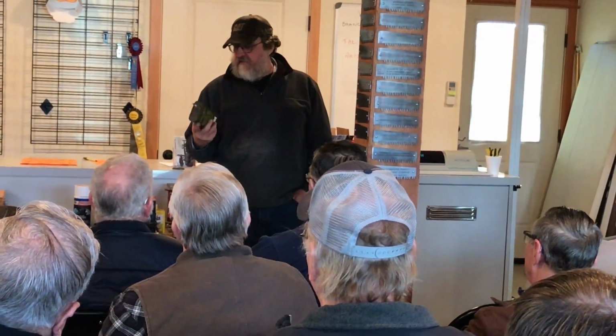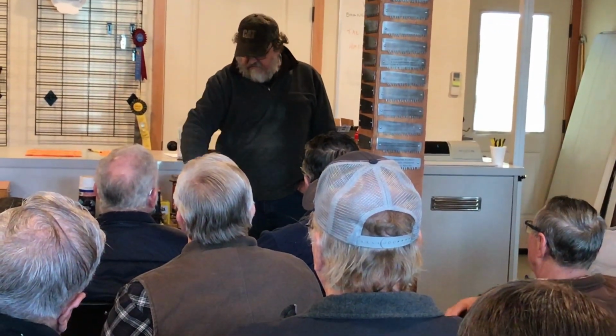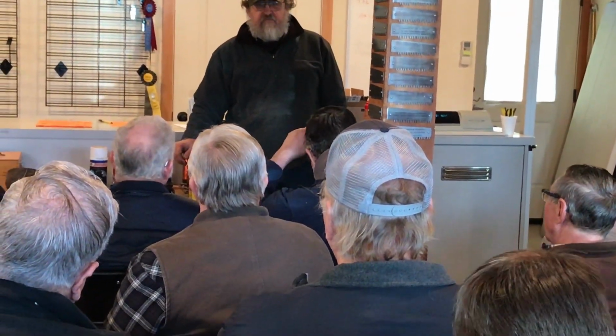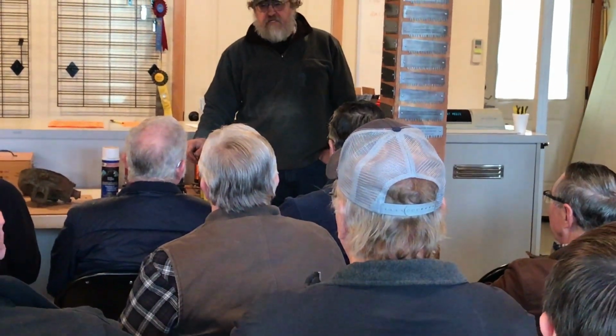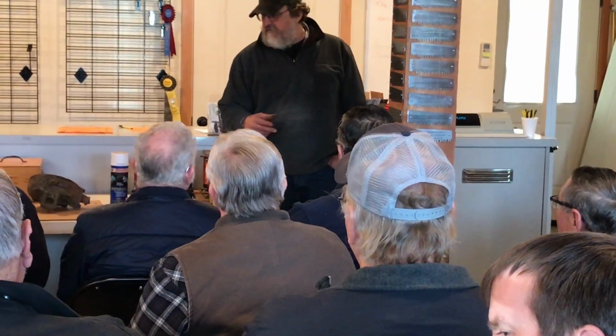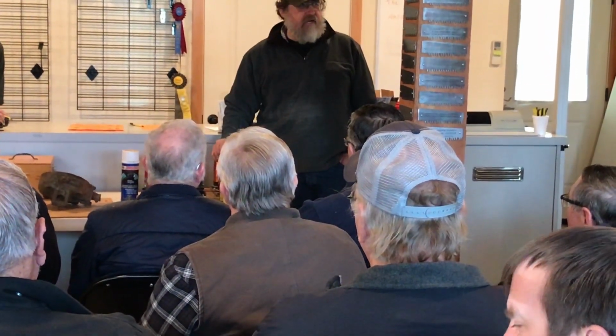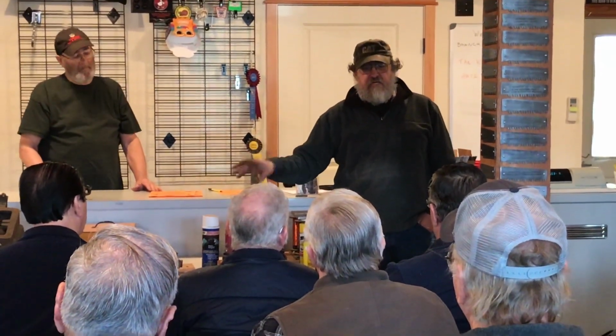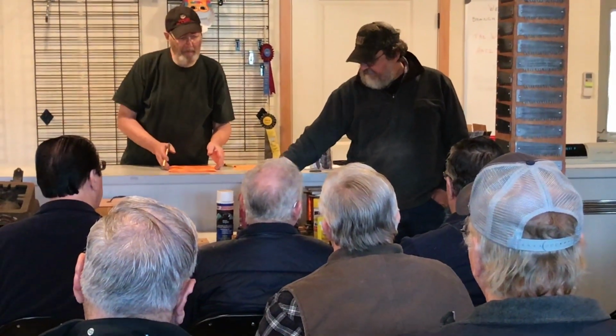What I do is I take some of this, the liquid wrench, and ATF, and some liquid WD-40, and I mix it up in an oil can, and that's what I use for my initial wet down of a stuck project, to just get it soaking in and get it broke loose.